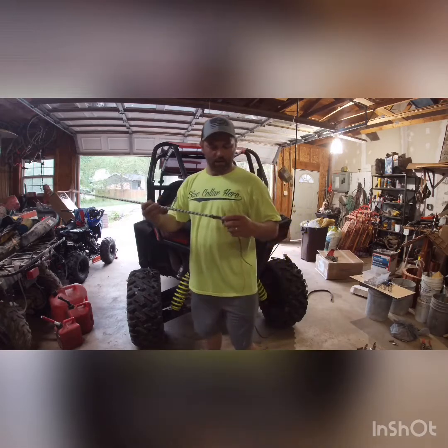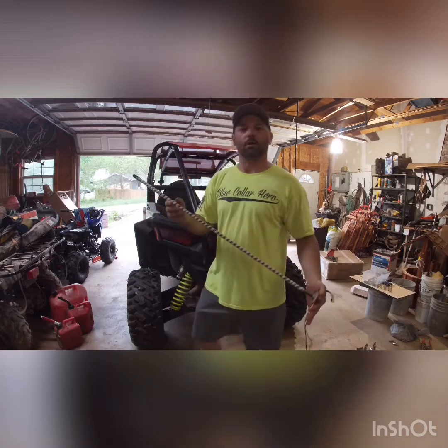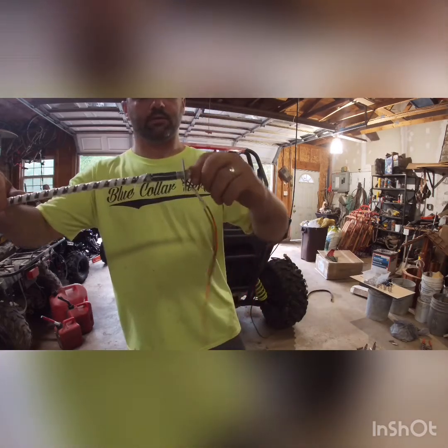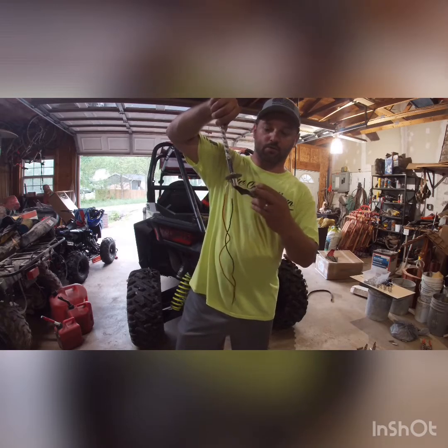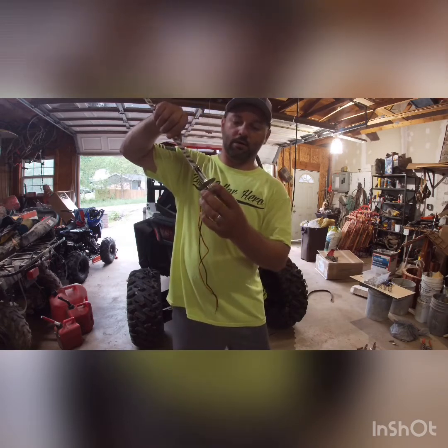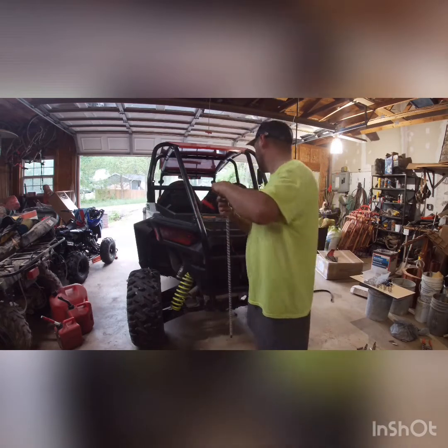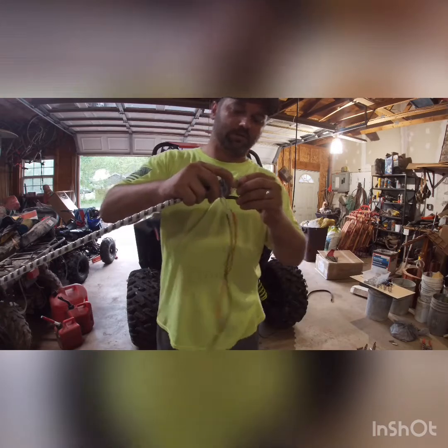What's up everyone, we've got the whip LED — we're going to do a second part of that video from last week where we made the light. This light comes in a couple pieces. What I did was take a washer, unscrew these last two parts, put a washer in there, and screw it back together. Then I drilled a couple holes in the bottom here for the wires to go through, and I soldered some longer wires to this.